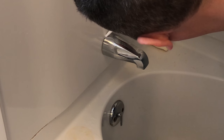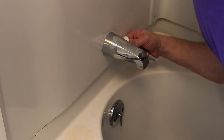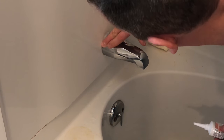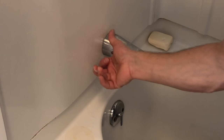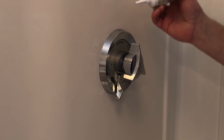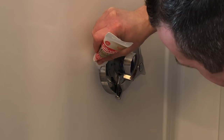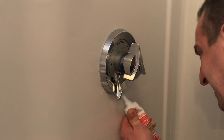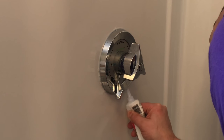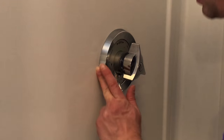I'm going to do the same thing to the faucet — just use your finger to push it in there. I'm also going to do the shower control trim. It's a good measure; it's not going to hurt anything. The shower head is right above it, so let's run a bead around that to make sure it doesn't leak down the road either. Run a thin bead, make sure you get all the way under it, then take your finger and work it in just like the other two, and get the excess off as well.